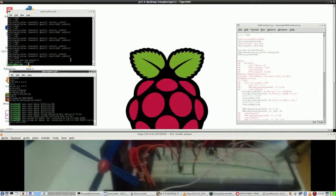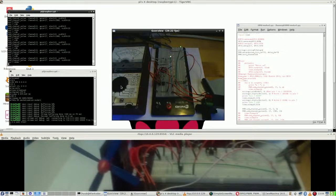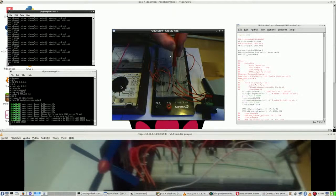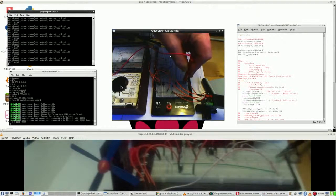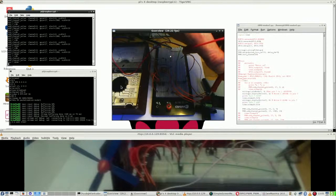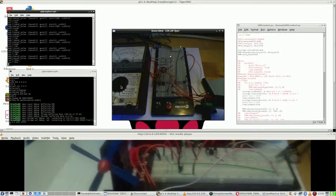So, going here, starting the program. So, what's the difference? Is there any difference? Well, first of all, as I measured here, there's 1 volt. Here is 0 volt. That is not enough for making a potential difference, so this LED will stay off. Here there's 5 volts. Here now there is 5 volts. Here too. But now the pulse width modulation is acting, or should be acting anyway.